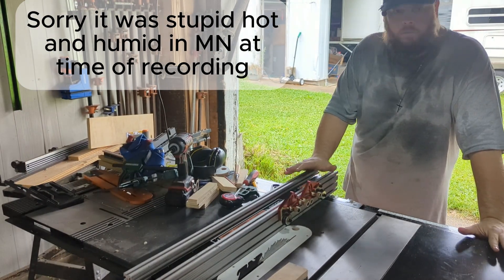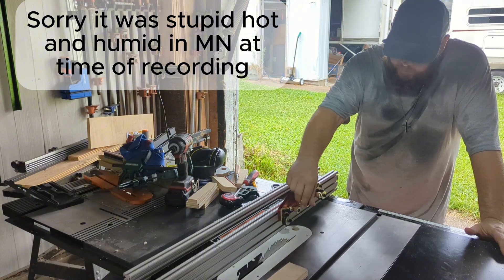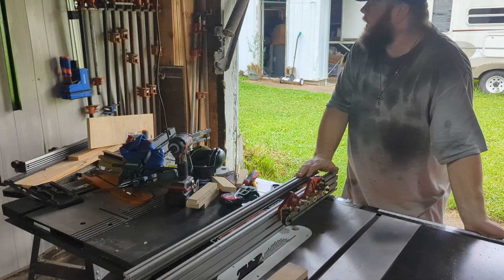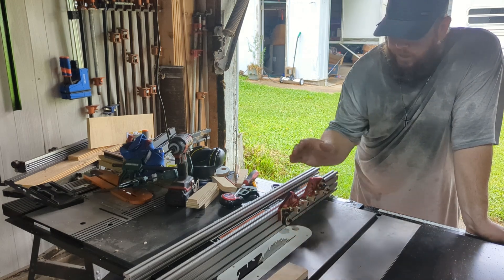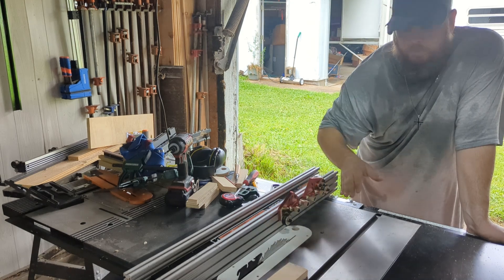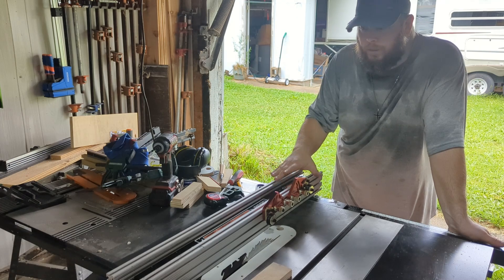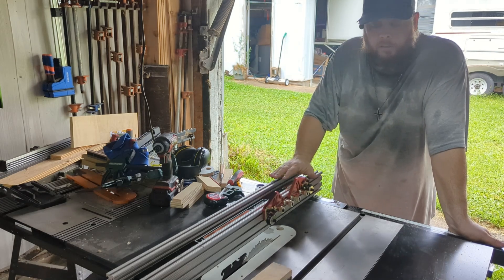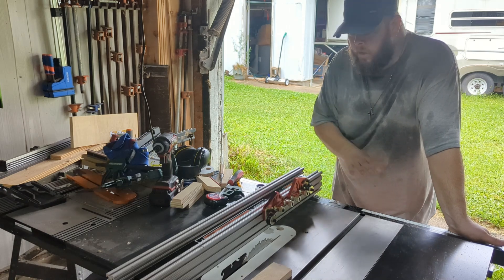You may be wondering why make a change like this - what was wrong with the other fence? Nothing, really. But this gives me the ability to start adding some things like these stock guides that I'm going to try out. I've even had in the past a kind of zero-clearance fence - say you want to put it right up against the blade, or if you have a dado stack and you want to run it right up against the blade for a rabbet, I'd put some screws in it and basically slide it in tight and have that type of fence. So this just expands my capabilities with the fence to attach things to it, and it's a little bit longer and a little bit taller, so it's just nicer overall. I do lose the low fence, but I didn't use that much - or at all, ever - so I'm not worried about that.